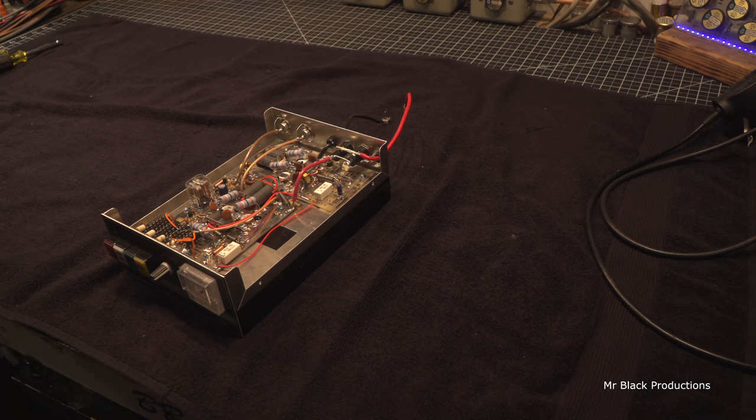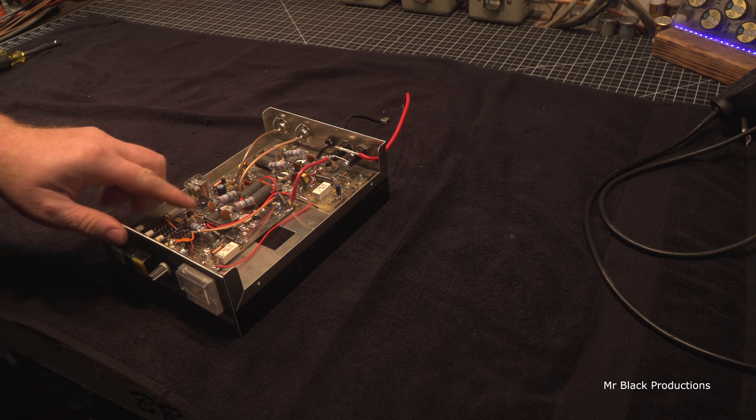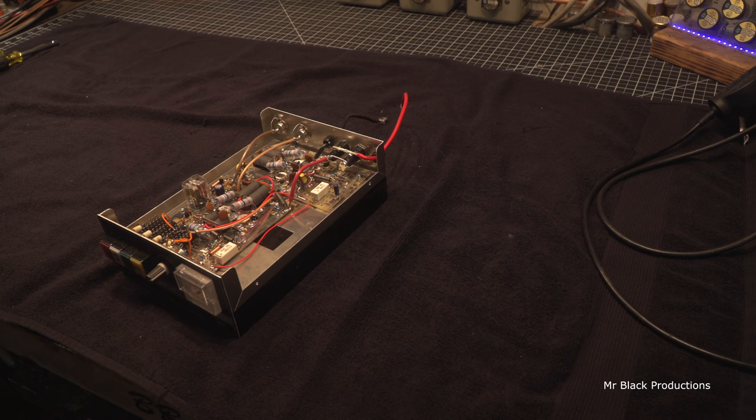And then what we're gonna do is we're gonna do power wire upgrades on this, and we're just gonna go through it. And I'm gonna change out his preamp so it's a little bit better transistor with a little bit lower noise floor. Not a lot, just a little bit. And then we're gonna mount a fan on it. So let's do that to it. Okay, well.